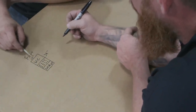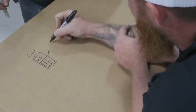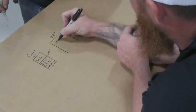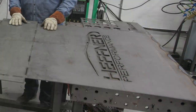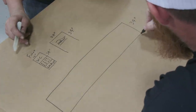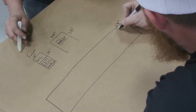In the upper area, we're gonna have the water cooler up top — the water cooler and the welding machine sitting up top right there. On the side, we're going to go 24 inches, the same height. We can put the logo in there on both sides. To lay the whole thing out across the full sheet, if we come in six and a quarter and put some relief cuts in here — that's six and an eighth for the material thickness — that'll be the center where our bend is gonna go, same thing on this side.